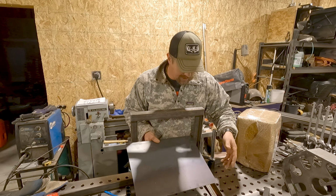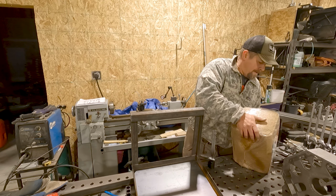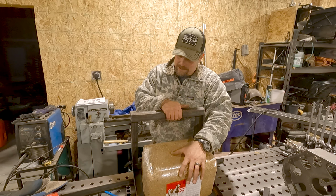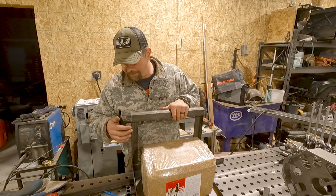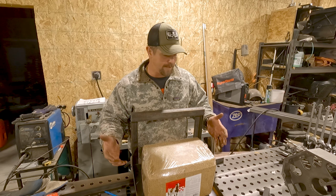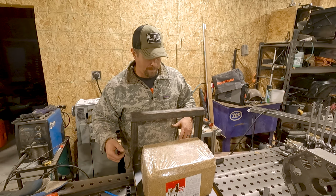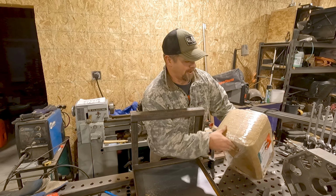All right, with this piece cut, it'll drop right in. I will need to just put a few tacks in that. This big mineral block, not just a mineral block, it's an all-purpose block for the goats, sits there just fine. I think it's plenty strong that I don't need to weld any angles, but what I do think I might need is to run them from up higher down to low, so that as the goats are hitting and pushing on stuff, this block doesn't come off as easy. So I will get a couple quick measurements and just weld something down the inside. With that, I'll get those things welded up, punch a few holes, and I'll be ready to throw it in the goat pen. I'm running out of daylight, so we'll do this really quick.